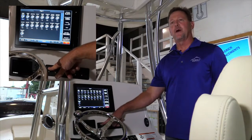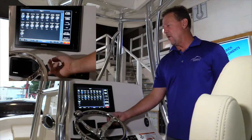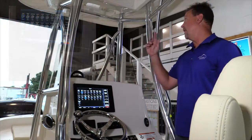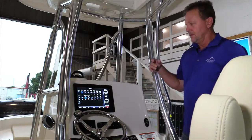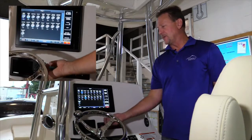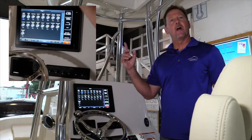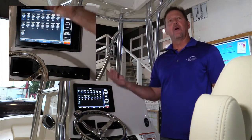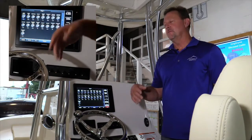A similar function is the first button, which is our nav light switch. If I hit the button once, you're going to notice that the nav and anchor light circuits are on — you'll see on the side of the boat your nav and anchor lights are on. If I want to toggle to anchor light only, I simply hit the switch one more time, turning off the nav light but leaving on the anchor light. Lastly, I can hit that switch one more time and have cycled all the way through: nav and anchor, to anchor only, then to off.